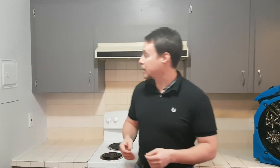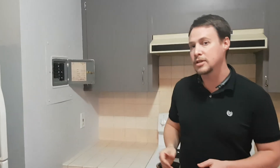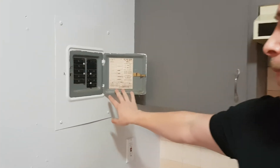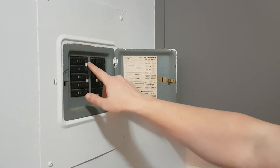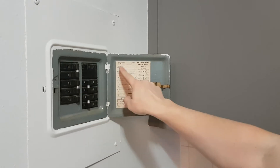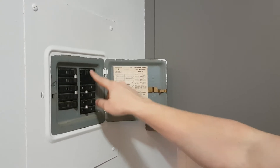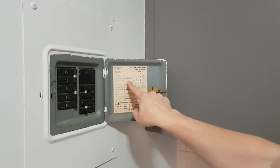So we're here in the kitchen and we can see off to my right we've got the breaker panel. So if I open this up, you can see in the breaker panel — we'll just cover a little bit of basic stuff here on breaker panels. We've got breakers and we've got a breaker map or breaker label. Now each of these breakers corresponds with a breaker on the label here. So I can see that breaker number one covers the den and lights in this apartment. Breaker three covers the dining room outlets, because they go down in sequence. If I go over here, I can see I've got a double breaker — this is a 40 amp breaker and in spots two and four it covers the range in the kitchen.